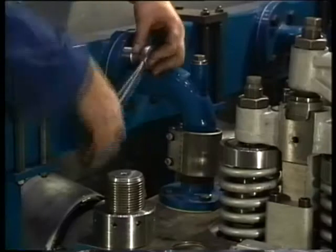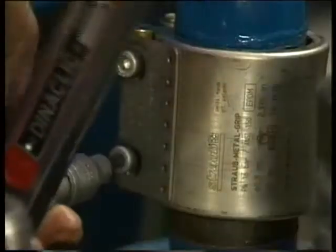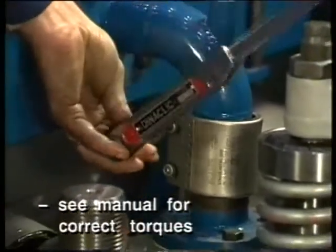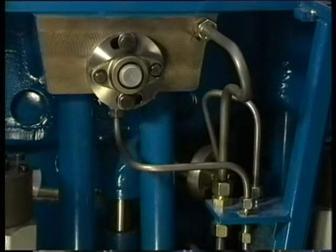Use a new gasket when the cooling water discharge pipe is mounted. The bolts of the rubber clamping piece are also tightened to a specific torque. Successively the pilot starting air pipe, lubrication oil supply pipe and the central drain pipe can be mounted at operating side.